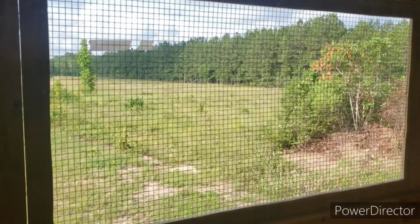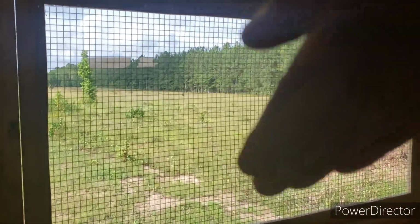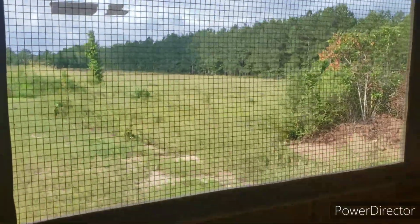But I'm gonna do the frame structure on the outside. Then I'll frame in that piece of plywood down there to give it some rigidity. And then I have to get some hinges. Basically, I'm gonna have it so I can hinge that thing open in the summer, and then I'll close it back down in the winter.